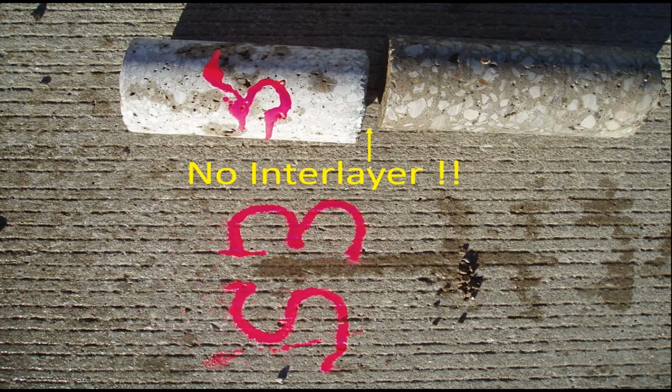And in this case, you've got to go in and replace it. The nice thing about doing this with a concrete overlay is that if you take out the interlayer, what's left of the interlayer, you can actually add another inch or so of thickness to the unbonded overlay and just use a fabric bond breaker instead. So you're not taking up that extra inch with asphalt again. You could actually just use concrete there and come up with a thicker structural capacity for it.